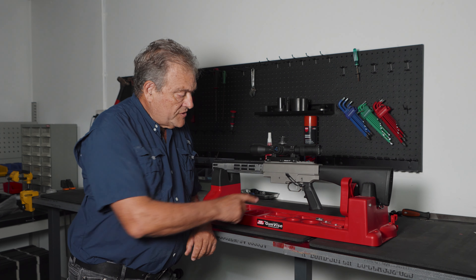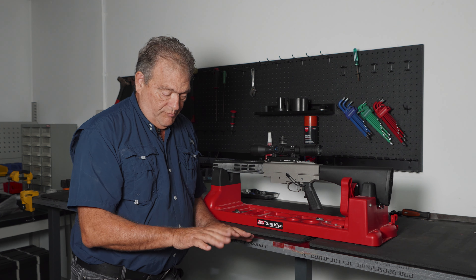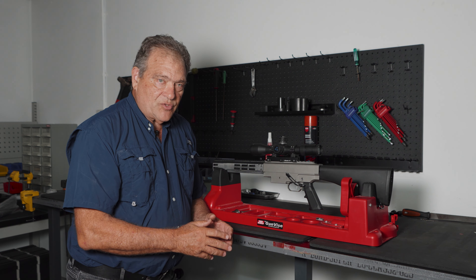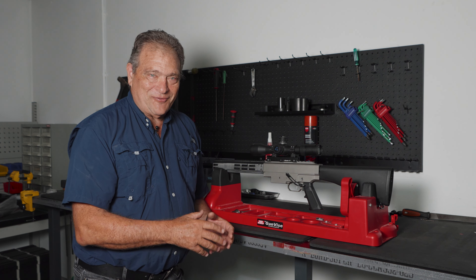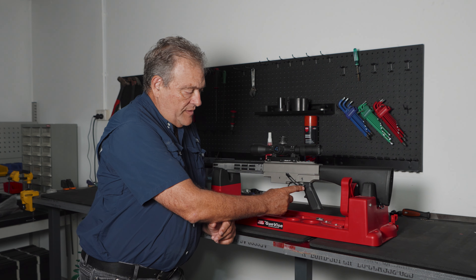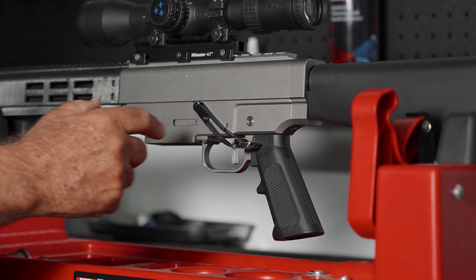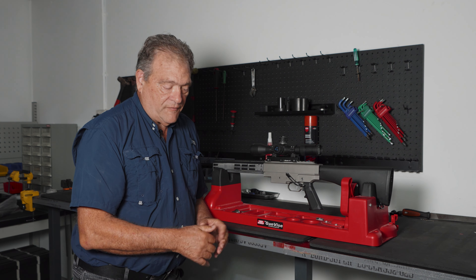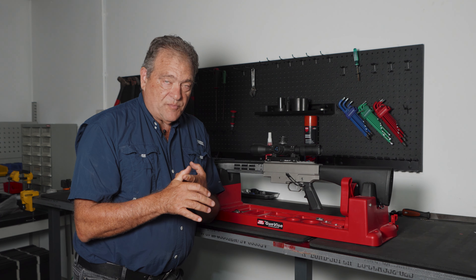The second point I'd like to raise is the lever. This is what I call a draft lever — we've developed it for my thumb, which is probably middle of the road. In the hands of people with much longer fingers, it's probably 10 to 12 millimeters too long and needs to be shortened up. Everybody's different, so it's going to be difficult to find the exact right location. We're going to try and find a happy medium. We think where this block — the actual thumb rest — sits is probably where it will stop. In the future, we'll probably look at an adjustable lever so you can loosen and tighten it to suit yourself. Some people like the pressure under the tip of the thumb; I prefer it under the power part of the thumb.